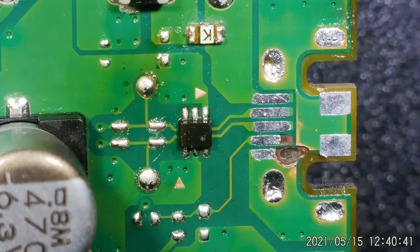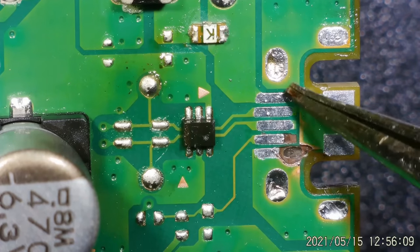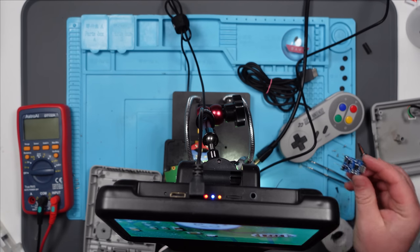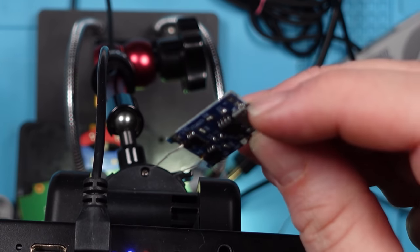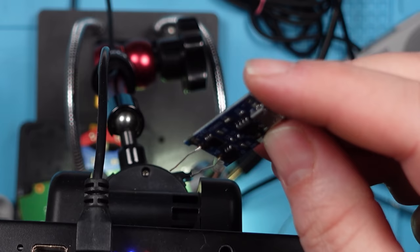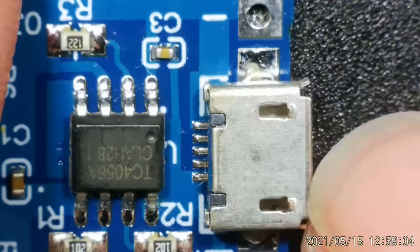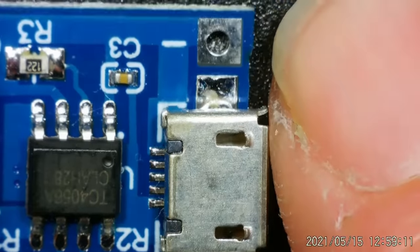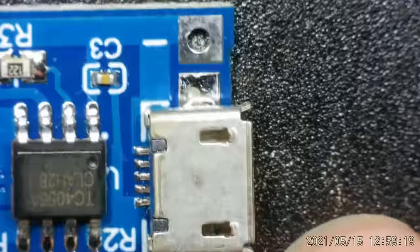I need to order some USB ports because I don't have any, unless I can take one off something else. Thinking about it, I should be able to use my bench power supply — it's only these two pins that are required, that's ground and that's the power. I've just had an idea: I've got these little charger boards — it's micro USB, five volts, with a plus and minus. So if I just plug a USB in there and connect some cables and solder them on here, it'll be a bit of a bodge but at least it'll show me whether it's going to work or not. You use these to charge up batteries — the batteries connect at this end, the USB port goes in here, and at the minus and plus we're getting it directly from the relevant pins on the port.